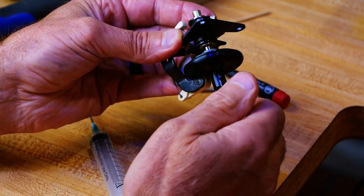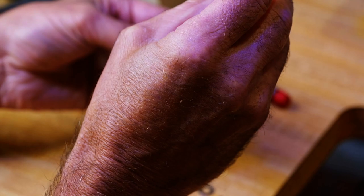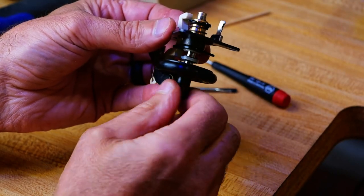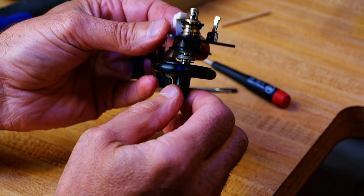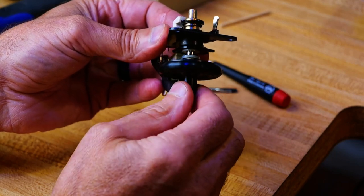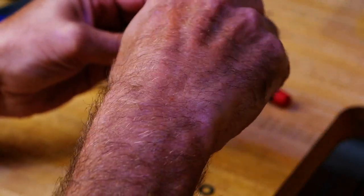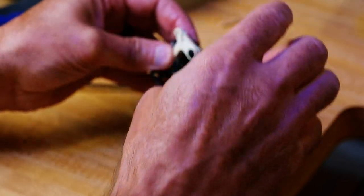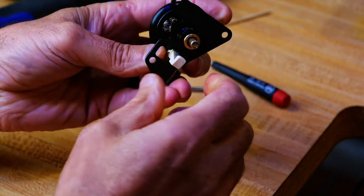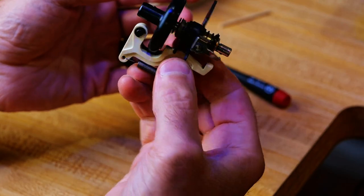All right, so I've played around with this long enough now. I think it's pretty clean. One of the things about a solvent is not only does it cut some things that are sticky or gummy, but if you keep putting it on there, it carries away whatever it softened. So be generous with it, and it'll carry the dirt away for you. All right, I'm going to blow that out with some air, and then I'm going to oil it and put it back.